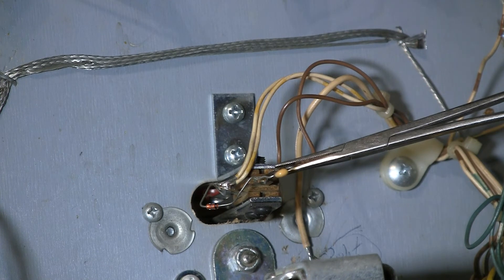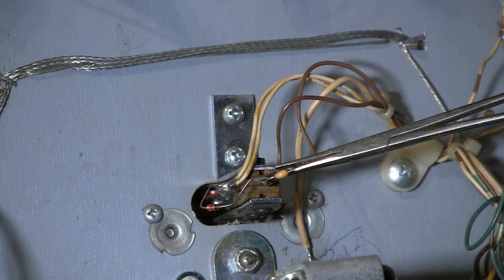So if you notice that you've got flaky switches on the machine, check to see if the capacitors have been cut off — if so, replace them. It's a 0.01 microfarad capacitor; this one is 160 volt 0.01 microfarad. They're fairly common — you can get them at Great Plains Electronics, Pinball Resource, or any electronics place. It's a standard non-polarized capacitor at 0.01 microfarads; 50, 100, or 150 volts will probably do fine. That's just a short little trick if you're running into switch problems on your Bally and Stern solid state games — that's probably the culprit. Until next time, thanks for watching, be sure to subscribe to my YouTube channel, and stay tuned for more videos as I update this Bally Paragon. Thanks for watching.